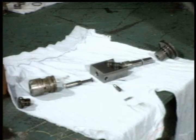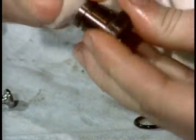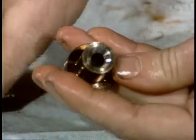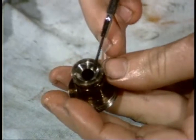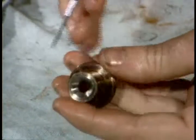This holds true for all your internal parts. The repair kit intended for a 3,000 psi valve will not work in a 5,000 psi valve. Check the pilot valve seat where the poppet tip makes contact. Look for any sort of damage or irregular wear patterns. Replace the seats if you find these conditions.